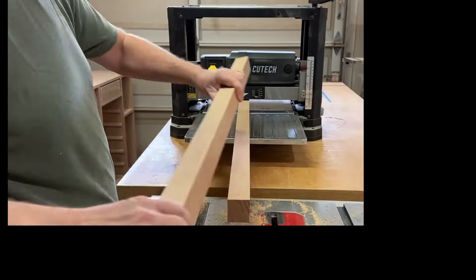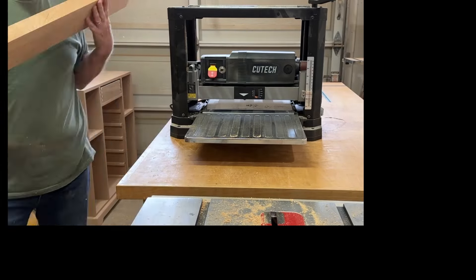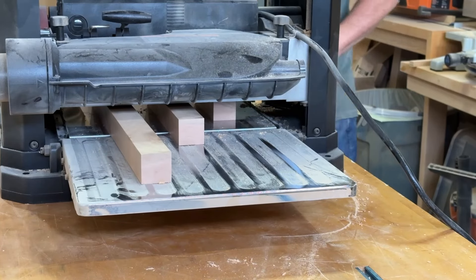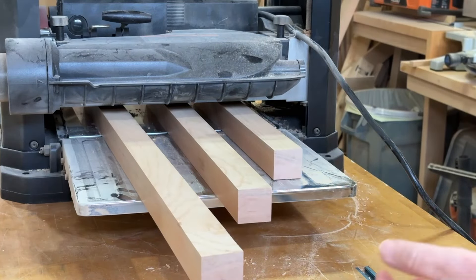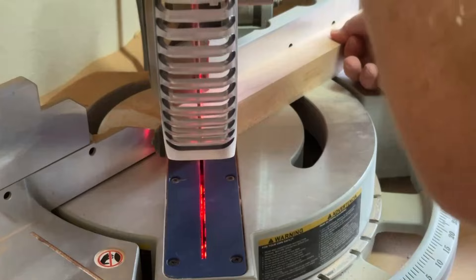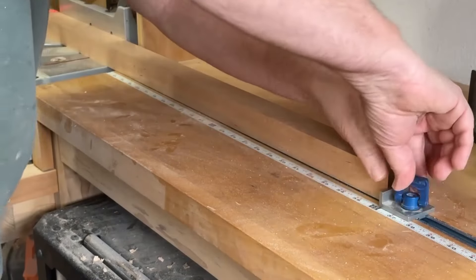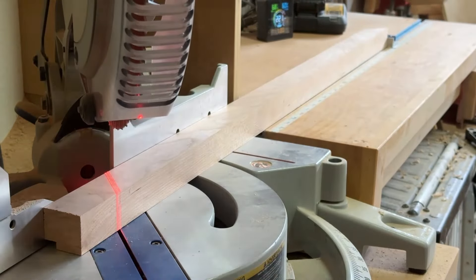I started by milling down some pieces of cherry to a consistent thickness for the frame at the top. You can see here in the background the partially made cabinet. I'll do a separate video on making the cabinet itself, so in this video I'll just be making the cork and epoxy top. This notch that I'm cutting with the router is for a quarter inch plywood base. Just simple 45 degree miter joints — I'm using the stop on the miter saw for the repeated cuts to get exactly consistent lengths and therefore a perfectly rectangular top.